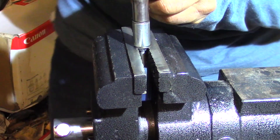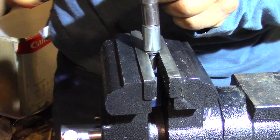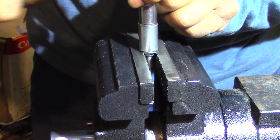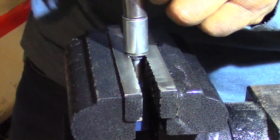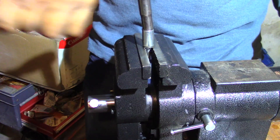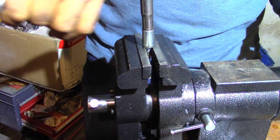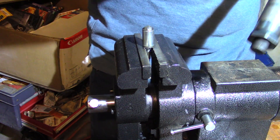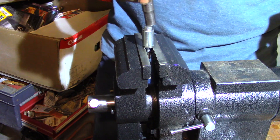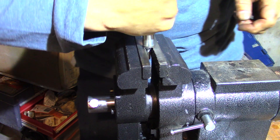I think it's breaking. I think it broke. Proving my point already. See what happened there? See the screw turning? So what happened — we lost the threads on the screw. And this is what I state: the threads in a nut are stronger than the threads in a bolt. The greatest force is right here within the first part of this nut.